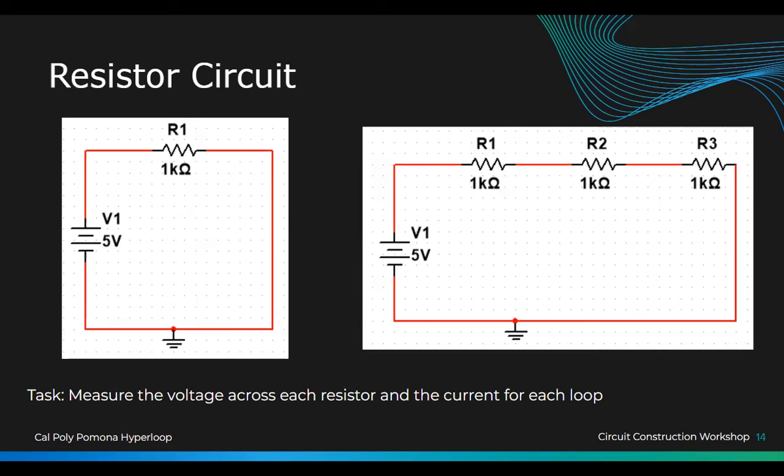Now getting that resistor that you had earlier, there are two ends to it, right? Yeah, there's two. So if I place this, you guys won't be able to see, but if I place it right there, with one end here and one end on that side. So let's put this where the V1 is, that's positive. When you see the smaller dash, that's the negative side of the power supply. So the positive side of the power supply is touching one end of the resistor. So let's do that on your board. And do not turn on your power supply yet.